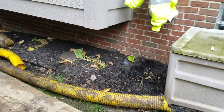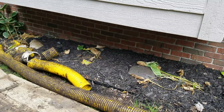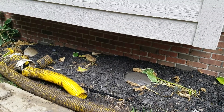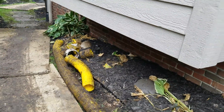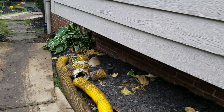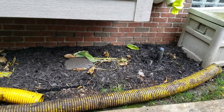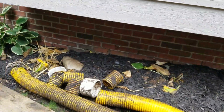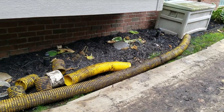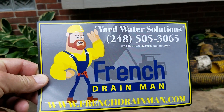I can see why the farmers use it — I would use knife cut over pinhole — but what happened was they put this pipe in the ground with a little bit of stone and they didn't wrap it with geo fabric. They did not use a geo textile non-woven filter fabric. The system quit, and what's unfortunate is the homeowner paid to have this service provided. Somebody comes in here, cuts corners, doesn't put in enough stone, doesn't put in any geo fabric — and here's the result.